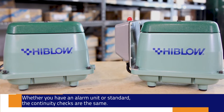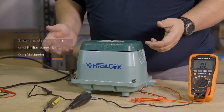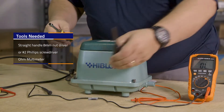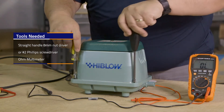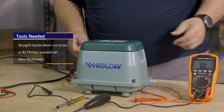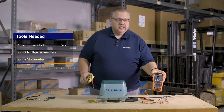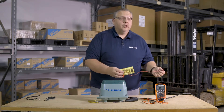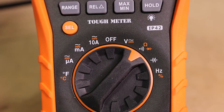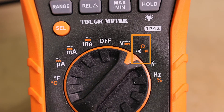In this video, that's what we're going to show you using some tools other than our eyes. The only tools really needed are a nut driver or screwdriver to take out the nuts — you can go either way, your personal preference. The other thing we're going to need is a multi-ohm meter, either a more expensive model or even a six dollar and fifty cent model from Harbor Freight. It all will do what it needs to do. The only thing it's got to be able to do is measure ohms, and if you look at the face that is the little horseshoe type symbol — the Omega — then you're good to go.